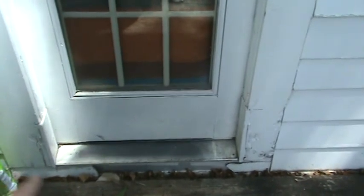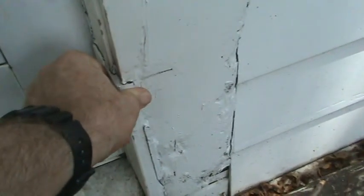While we're at it, the owner may want to have us repair this rotted frame right now. Once you get moisture in the frame with all these trees and stuff, it draws carpenter ants and termites, and you're gonna have more trouble if you let it go. This has been repaired before — they didn't have the right materials, so they did a cut down piece. Instead of overlapping, this is one by four inside and one by eight on the outside. He tried to cut out the rotted wood and slam in a piece of five-quarter board. He made a horizontal cut so all the water's getting in behind it and rotting it out — I can push my whole hand right through it. It's not a huge expense, but it'll become a huge expense if you don't stay after it.